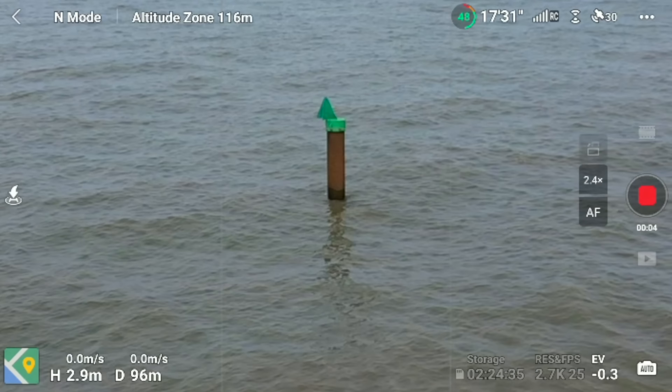This falls into user error if not done correctly. Don't just turn your drone on and fly off towards a boat, because as it flies out 50 to 100 meters over the sea, that's when it gets full GPS lock and sets the home point — which is now over the middle of the sea. If you lose signal, the drone will return to that home point and continue to land into the sea. So get to your location, turn the drone on, let it sit in place until it gets full GPS lock and says 'home point updated', hovering close to you over land first, then go off towards your target.